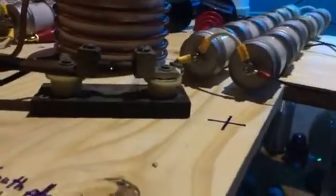See the behavior difference here, watch. And everything's at over 40,000 volts, and you get a little bit of discharge going on there constantly. See? I'm not sure if that's a 470 volt rated. It's not a 3,000 volt rated GDT, so that's about twice as wide. But that's probably a 470 volt GDT, just to make sure something arcs over in there.